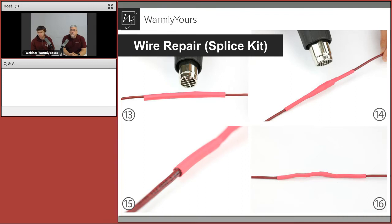The last step of the repair is adding the final heat shrink — centering it over the repair by feeling where the repair is, then slowly applying the heat gun over the whole repair to make sure it melts evenly all around, creating a nice waterproof coverage around the wire. The great thing about these heat shrinks we provide is they have glue inside. As you can see on image 15, when that glue comes out the edges, your repair is done correctly.